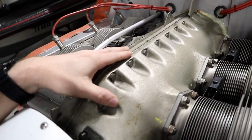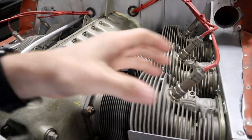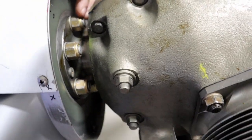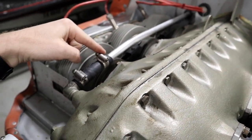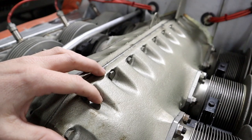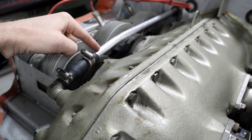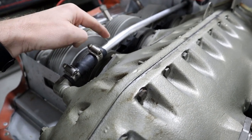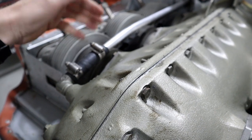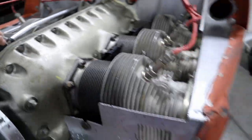Here's our crankcase. Our crankshaft goes through the center of this — when it's turning it's drawing the pistons in and out, and that's connected to our prop. You can see our prop bolted up right here. Here is a vent line, it's called a breather tube. If you're getting a pressure build-up in your case it's going to vent out this tube. It's pretty common that after a flight you might have a couple little drops of oil next to your nose tire — it's probably coming out of this vent tube because it'll sling a little bit of oil out.